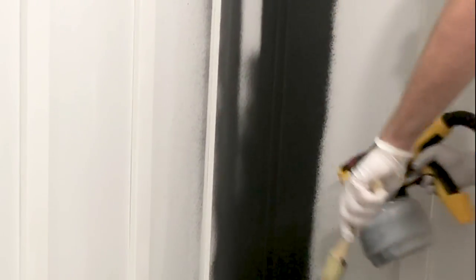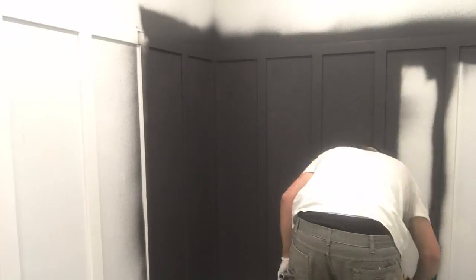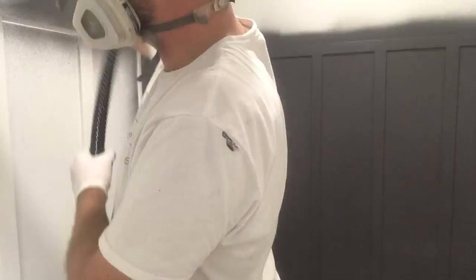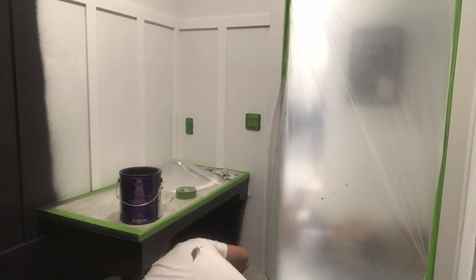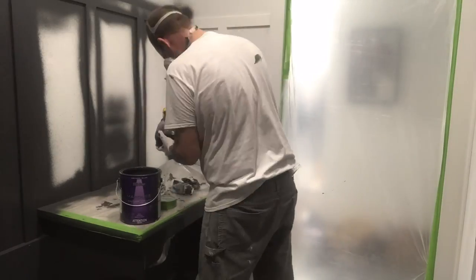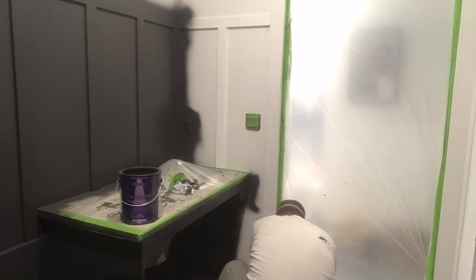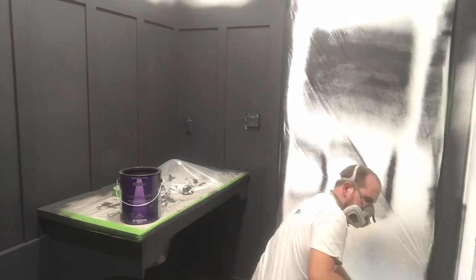Occasionally there was a run in the paint or some minor touch-ups that we wanted to do, so we made sure to have a paintbrush on hand at all times while spraying. It took about half an hour to spray the entire room and the paint went on in a really nice smooth thick coat, so we only had to do one coat total. With about an hour of prep work and half an hour of spraying, you can really see how using a paint sprayer would be beneficial in the long run, especially if you paint more than one room a year like we often do.